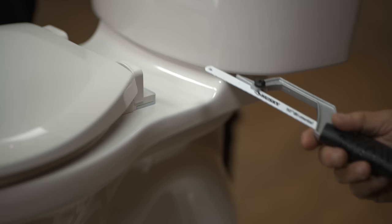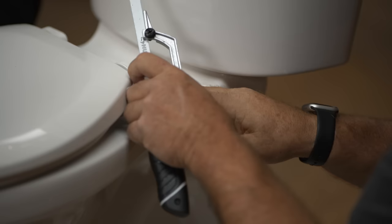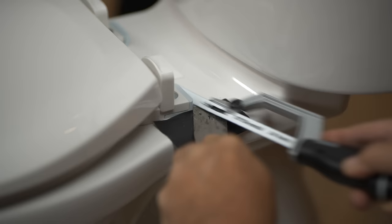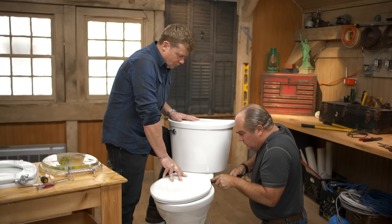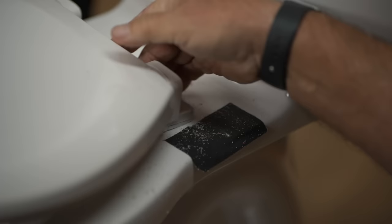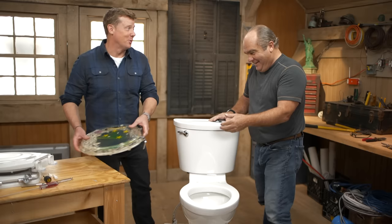So the last resort for those cases, or when a plastic one won't come out, is to actually cut that connector off without defacing the china. You want to cut up top as opposed to down below — there's a little lip that doesn't let you get up inside, so you're really forced to do it from above. At the least, you want to put some protective tape. You certainly want to use everything you can to make sure you do no harm. So now you come in here — starting to grab it. That was easy. Bolt is gone.